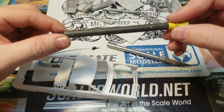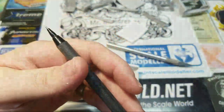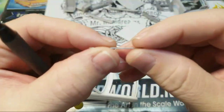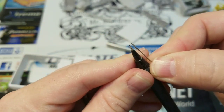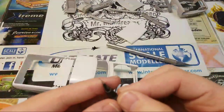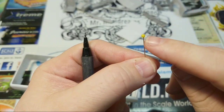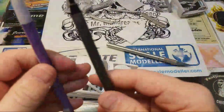This right here is a scribing tool that I made. I took a mechanical pencil and inserted a straight sewing pin — I cut the head off and shove it up into the pencil hole. Whenever this one dulls out, you can always keep a new sharp point in there. I've got this size and a smaller one — the ones with balls are always smaller. They're just sewing straight pins, and having two different sizes gives you more options.